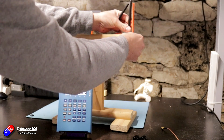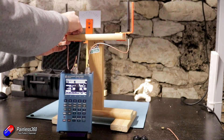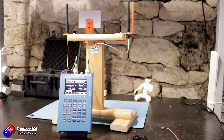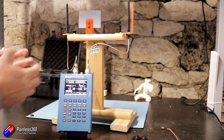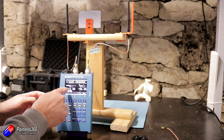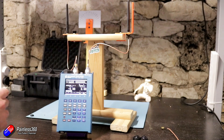We'll pop it onto the test rig here. So this is the two linears. We've set the frequency to 5650 because I tested the antennas and found that 5650 covers all these antennas. The two linears are slightly out of tune but to get a good comparative measurement we went with 5650. We calibrated and zeroed the system, so now this is a zero-field test. We then add the other antennas on and it should tell us the difference in gain between the two sets of antennas.